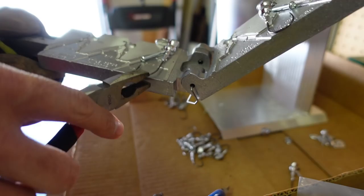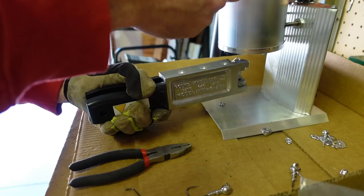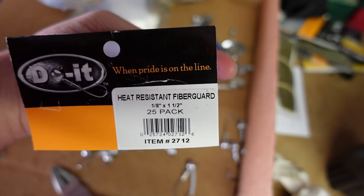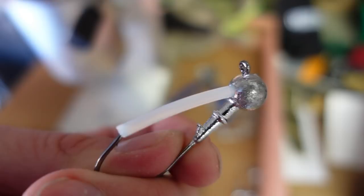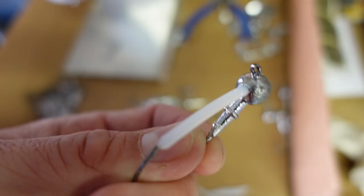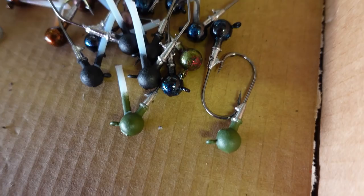Looks like both sizes came out well. I had to break these open — these are the heat-resistant fiber guards. You put that little fiber guard inside the hole so when you dip it in powder paint, the paint gets hard but the heat-resistant fiber guard keeps your hole nice and open so you can put your brush guard in there later.